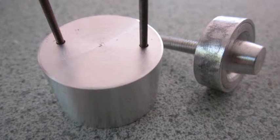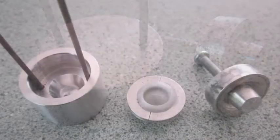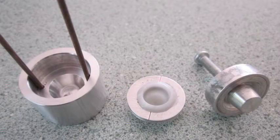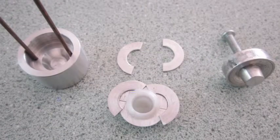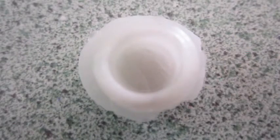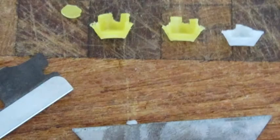Put 2 pins in the bottom die injector holes. Push the moulded button cover out, taking the 3 split washers with it. Slide each half of the split washers apart. Trim off any flashing as required. Slit the spear locking lip into sections and remove the in-between one so that it can fold in when pushed